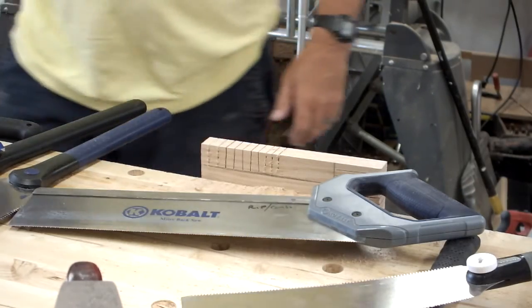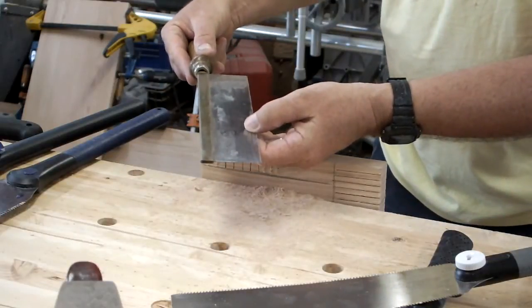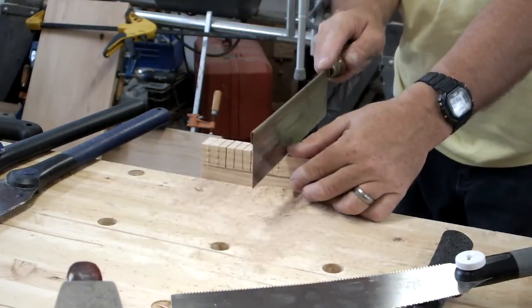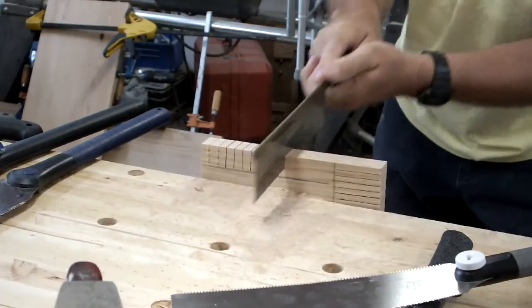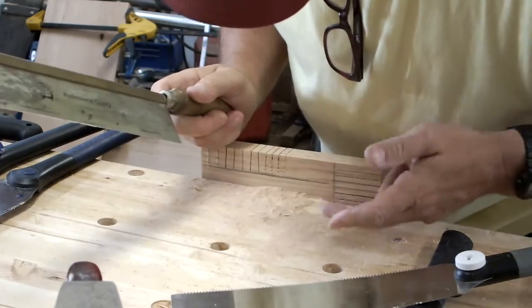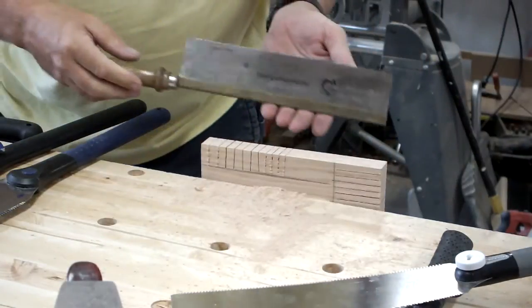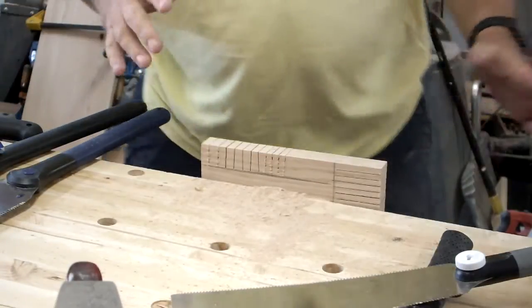Incidentally, sometimes I use an old gent saw. This is 25 years old. Really old saw. It would be comparable to the Crowns you see, the Two Cherries, and some of those brands. This has been filed by me. 1, 2, 3, 4, 5, 6, 7, 8. Good clean cut, good straight cut. Tear out is very minimal. So this is a good saw. It's just small capacity. So these are all considerations. I know this is unscientific.